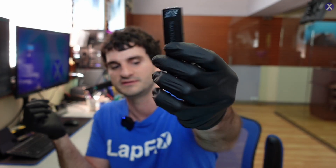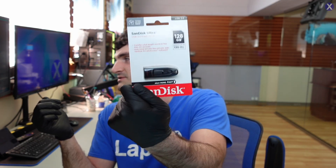We see that a lot. It's usually not great to put important stuff on a USB, because over time — especially on a much older USB — how NAND works is it will eventually fail based on a certain amount written to it. For SSDs, you'll see the warranty is covered by terabytes written. It also has a PCB with a controller and other components that can fail. They're not as well built as SSDs. They also gave us a new SanDisk USB to transfer the data to, which is better than cheap aftermarket ones you get at convention events — those have cheap NAND, cheap flash, and if it's like a $2 USB, it's going to fail pretty quickly.